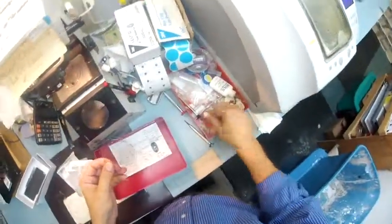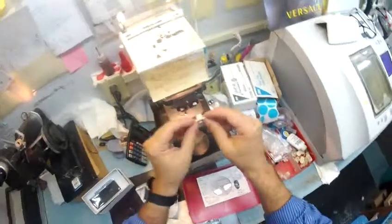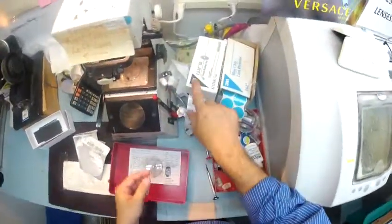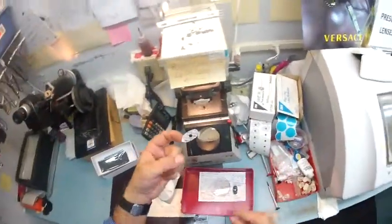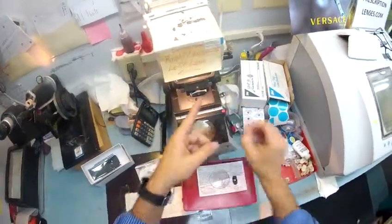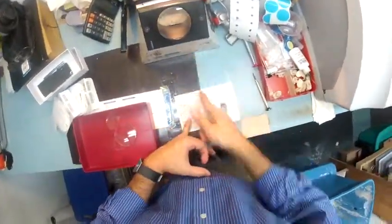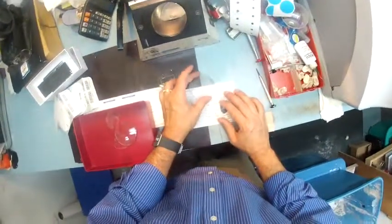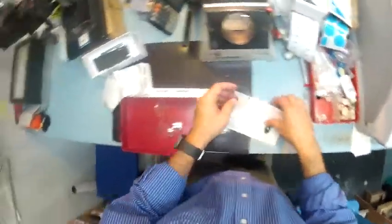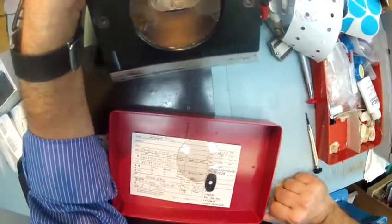I need to put this block on here — this is what's going to hold the lens in place while it's cutting, essentially holding it into what's nothing more than a lathe. This is called a block, a 3M blocker — the same people who make Post-it notes make my little double-sided sticky pads. The black side is the sticky side; I stick that on, pull away the tape making this side sticky. I've got optical crosshairs — a vertical meridian and a horizontal meridian — and I want to make sure that I get your lens right on that 180, with that dot on the vertical, so I'm dead center of the crosshairs. It's essentially an optical scope, just like the crosshairs of a rifle scope.